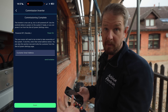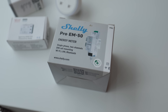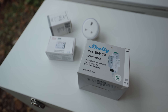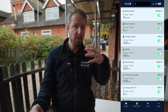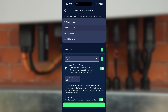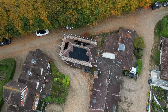We add the customer's email address and hand off the system so they can monitor it in the 11 Energy app. A cool feature is that the app integrates with Shelly devices — for example, the EM Pro can be clamped around an EV charger circuit to stop the batteries from discharging into the vehicle, or a smart switch can control an immersion heater so excess solar pushes energy into it. You can also set different work modes and smart schedules to work with smart tariffs, scheduling charging and discharging of the batteries to make the most of them.